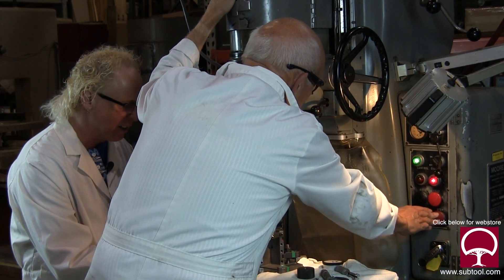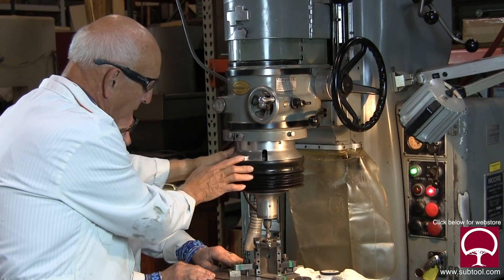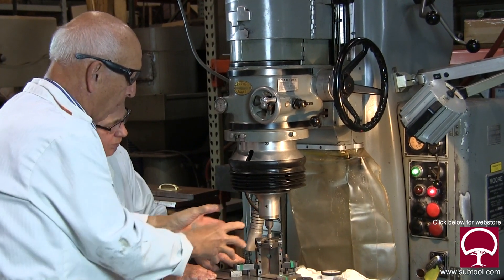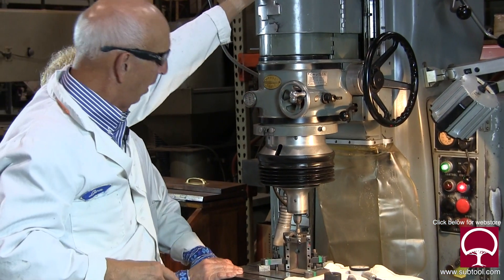How do you find center? Right in through here — there's another adjustment that moves the whole spindle back and forth. If you want to do a big hole, you come in here and bring it out, then fine tune it up here.